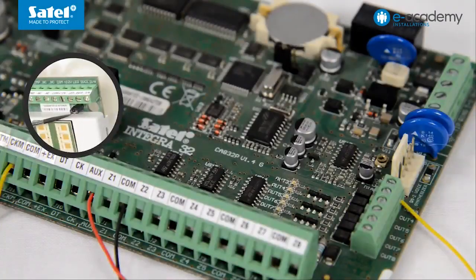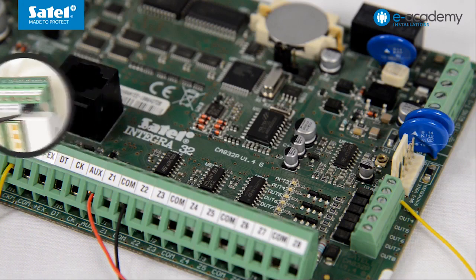In this case, the Opal Plus Detector is connected to the Integra Alarm Control Panel. The SVCE terminal on the Detector Electronics Board is connected to one of the low current outputs of the control panel, programmed as Service Mode Status.